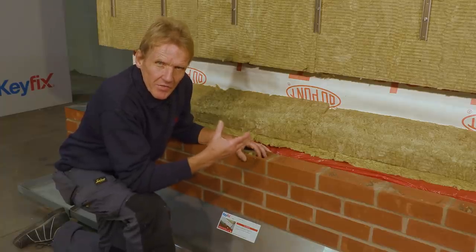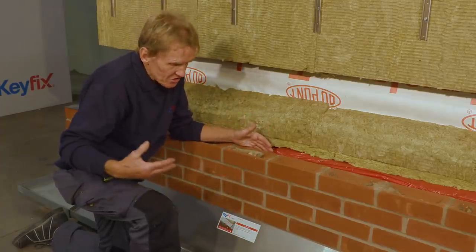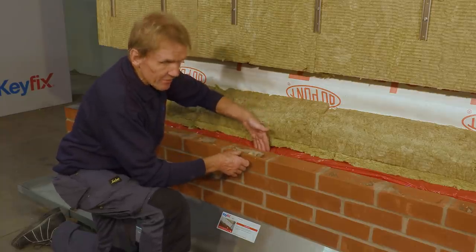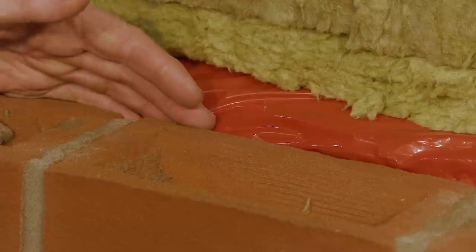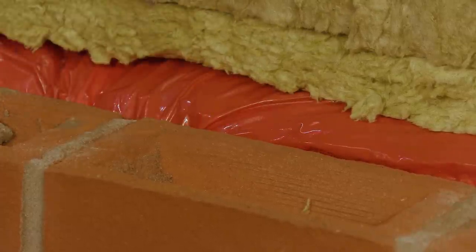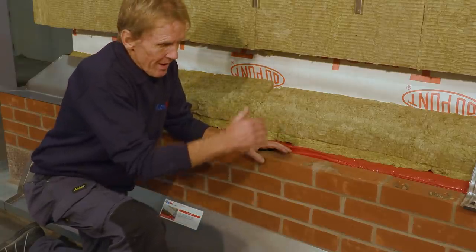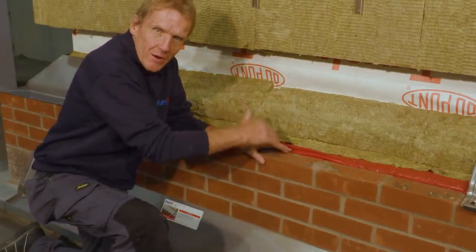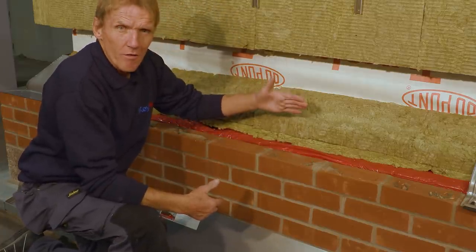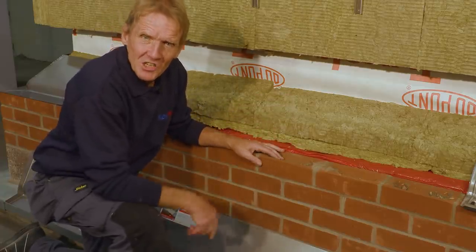Now, every bricklayer knows that the function of a cavity tray is to deflect any moisture that's penetrated the outer skin through windblown rain and is running down the inner side of the outer skin. And it deflects that moisture to the outside through a series of weep vents. Cavity trays are typically used in areas where that moisture might transfer from the outer to the inner skin. And typically that could be something like over a fire stop, a masonry support system, or even a ventilation duct.